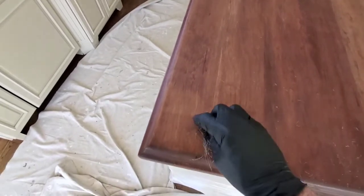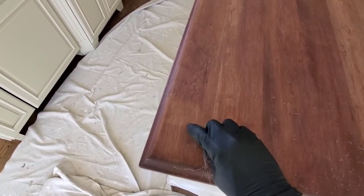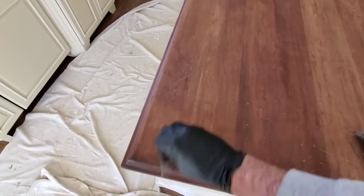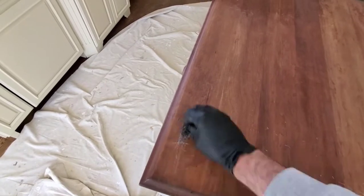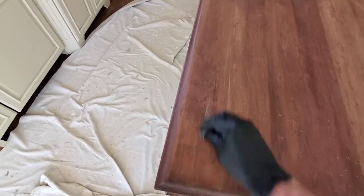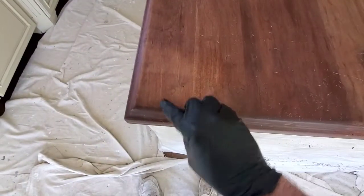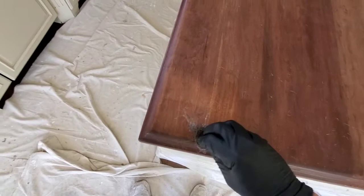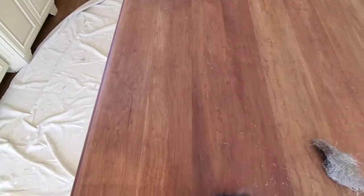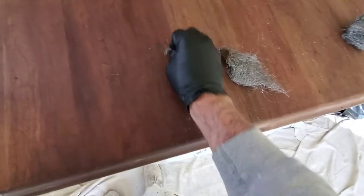Something like that, that line, if you leave that and if it doesn't come out in sanding, you'll stain it that way, and there's no natural lines like that hardly in nature. So you're gonna go over that a little bit, and you can see it's lightening up. And there's also dry issues. You see that? Now this will dry the more I sand on it or scrub it with my steel wool. I keep saying sanding, but you kind of are when it comes to this. I don't want a bunch of quick stop and go marks, you know, that kind of stuff.